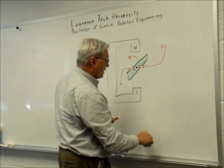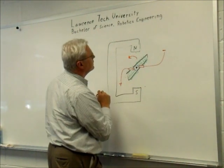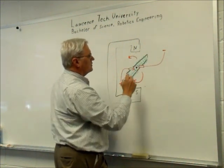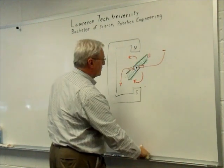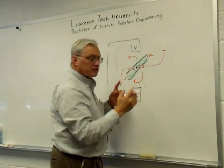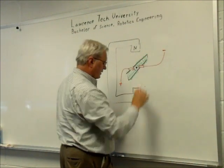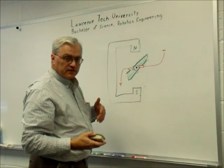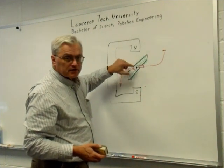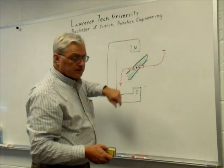If I want the motor to turn in the other direction, I make the connections negative and positive — switching the polarity — which changes the polarity of the magnetic field and causes it to rotate in the other direction: instead of making this end south, which is attracted to the north, this end is now north, attracted to the south, and vice versa. So by switching the direction of current flow, we change the direction the motor rotates. The motor has a number of different components: the brushes conduct electricity into the armature, the commutator controls how the magnetic field is generated in the armature and its direction, and the coils generate that magnetic field.